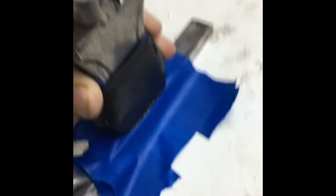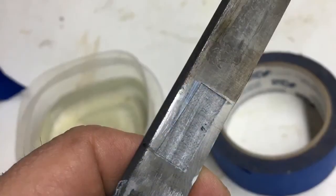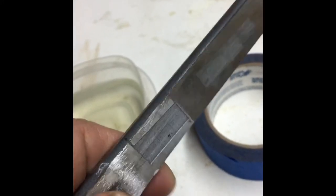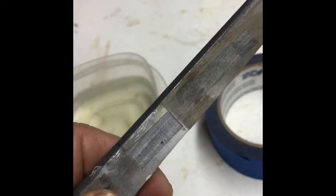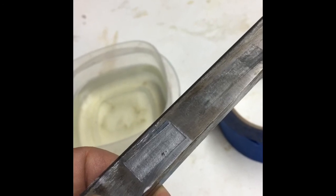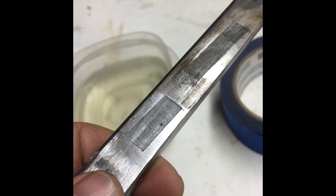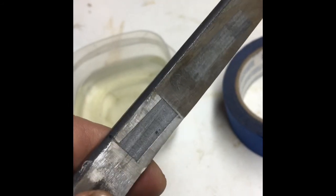My next video I'll try and show what kind of depth I got and detail how many times I put it on. Here is the piece of 1095 steel — you can kind of see how deep that was. I did five or six applications, counting to ten fairly slowly, and between each application I cleaned the surface off and tried to get a good look at it. It would be a better test with my stencils from Tusk Technologies, which are awesome. Hopefully this gives you guys good information — try it yourself and maybe come up with something a little bit better. Thanks for watching.